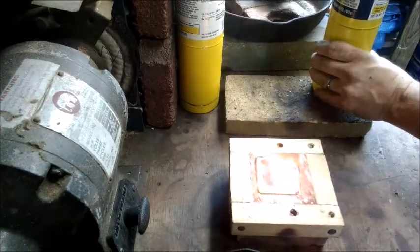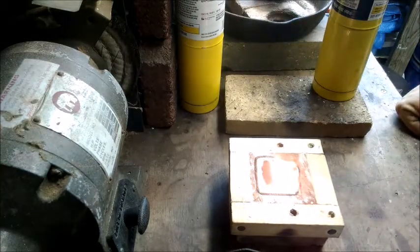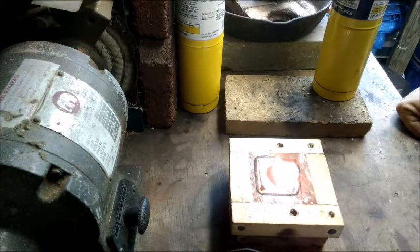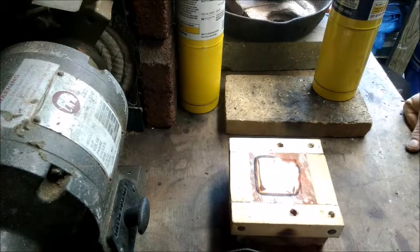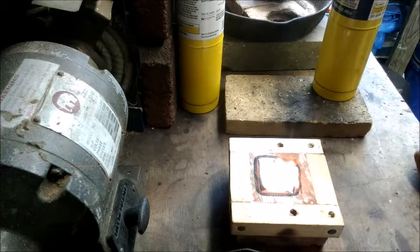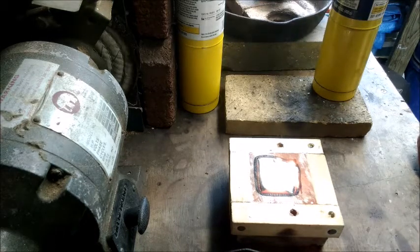Well, that wasn't quite enough silver. Needed at least probably the full five ounces that these were before in the graphite mold before it broke. We'll have to do this again. Not done yet — we'll give this one more shot and see how it turns out. That little bit right there is something I really don't want to have happen because I don't like it doing that final little bubble-up right at the ends where it gives you a weird formation in the middle. Hold tight, we will be right back.